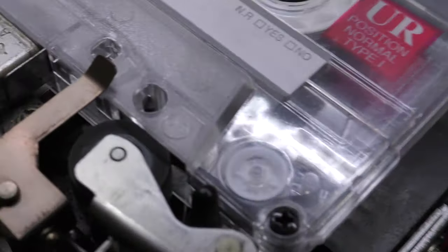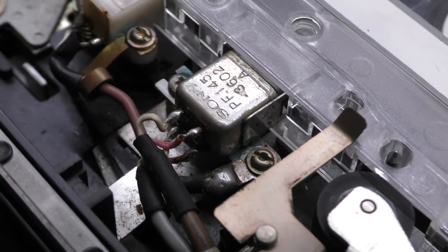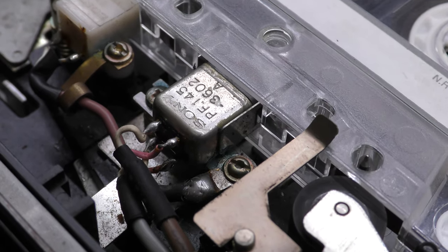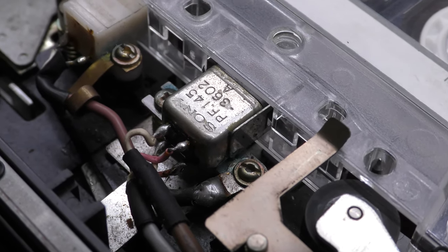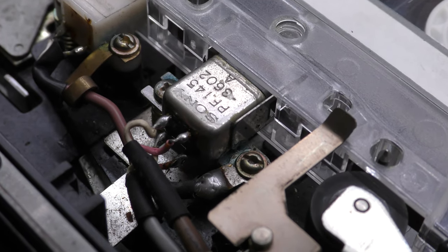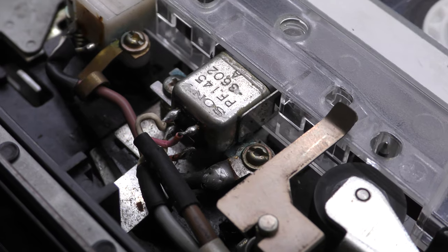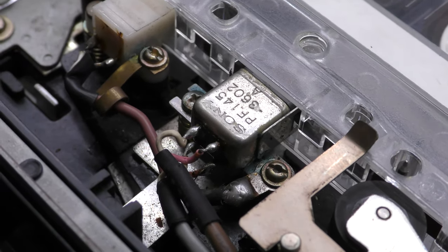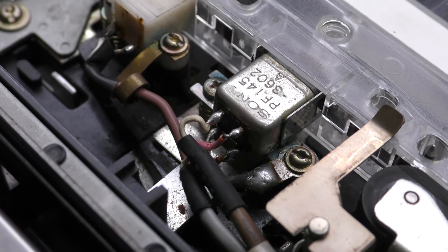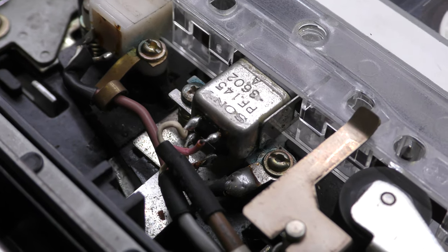Right, so we've got two channels again. The fault actually turned out to be the pink — the lower pink wire on the head. One side of the head is grounded for playback and lifted to the bias and record amp. I could get a ground on the switches but I couldn't get a ground on the head. It didn't look broken, but when I gave it a yank it broke off. So it was simply the pink wire on the head — nothing more complicated than that.